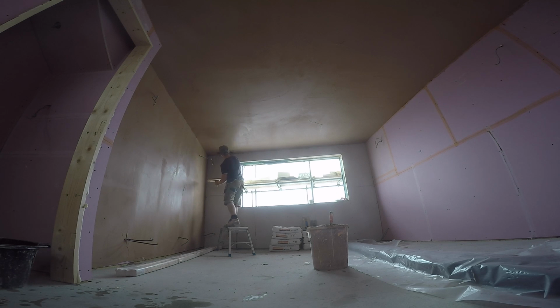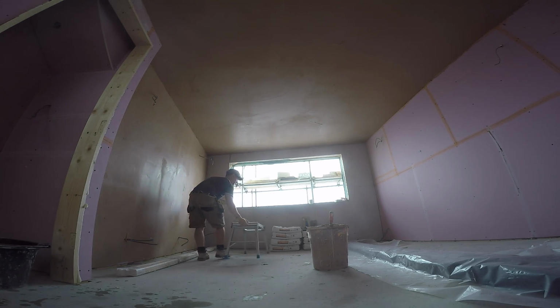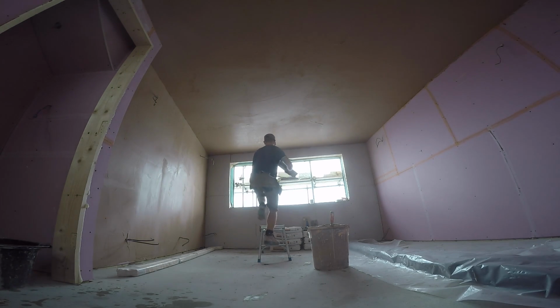Yeah, you should be on a winner. Obviously, because that wall's there, I'm taking a bit of time, making sure I'm not hitting it, and trying to keep the outer edge clean, but we won't go into that. I recommend, as a beginner, just work on hard angles. At the beginning, don't work with wet plaster on both sides. You just struggle. It makes it hard for yourself.